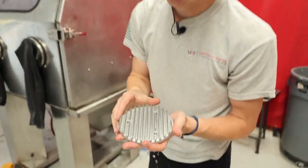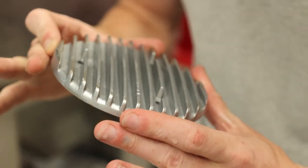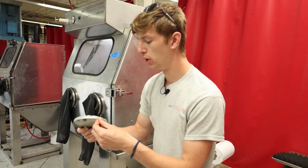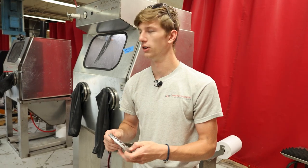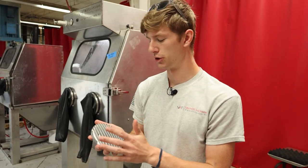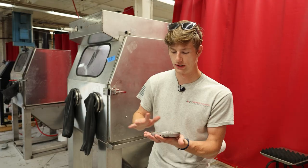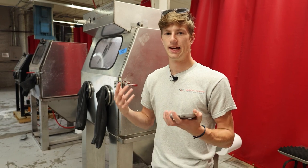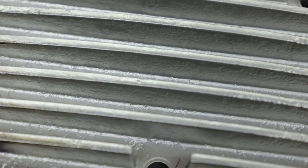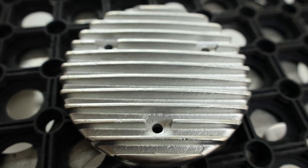Now that is by no means chrome, but as far as bringing back pitted aluminum goes, that looks fabulous. If you wanted to recoat that now, you definitely could — I wouldn't, I would leave it like this. If you wanted to use something like Cerakote, I would probably do it after the aluminum oxide. But if you guys have very good chrome that's just got some corrosion or dirt that you want to smooth over, glass bead is most definitely the way to go. On the underside, it did brighten it up a little bit — it allowed the media to roll over, scrub, and bring it back to life. But the top section that was just flaking off didn't look great, so it made a lot more sense to just take it off and bring it back to this polished aluminum look.